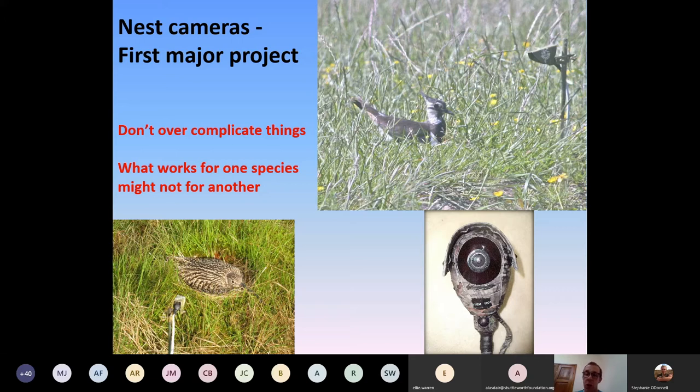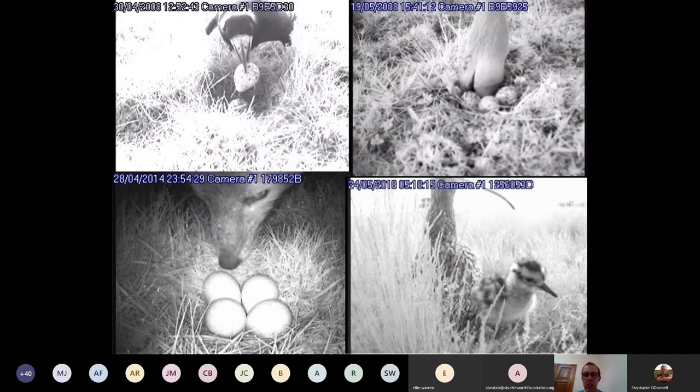We've had to move on due to component obsolescence, which I'll touch on later. The system met its purpose — just a basic black and white camera. Most events were at night so infrared was perfect. We found out whether the nest was successful, whether there was a sheep's hoof in the nest, or a predator like a fox. Higher resolution gave more power which brought more problems for system autonomy. Think simple — design to the minimum requirements.